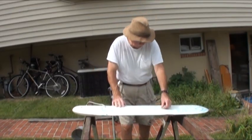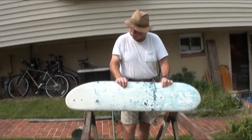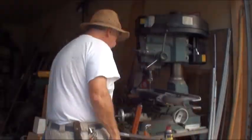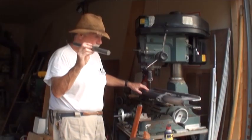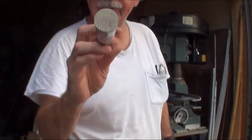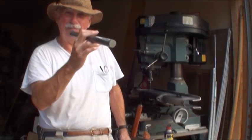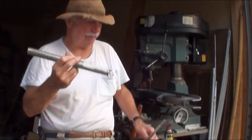The rudder was coated with paint — I had to chip it all off. I'll probably do a little more on it, but it's not in bad shape. It's actually fairly high-tech: hollow inside, it fills with water and drains when you pull it up. What I've been waiting for in the mail was the stainless to make the sleeves — it came today. One inch stainless. This little chunk cost me $22. I believe it's 316, which was recommended for marine use. I've worked with 304 and it was really hard; I'm hoping this is annealed and I can cut it. To the lathe!